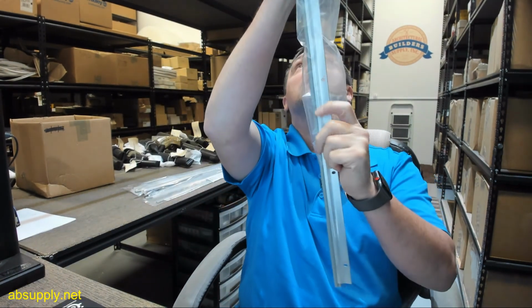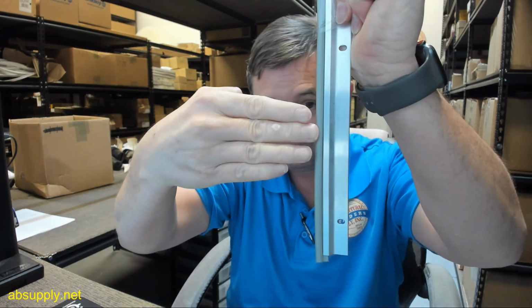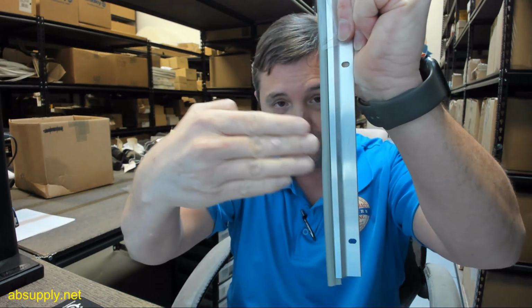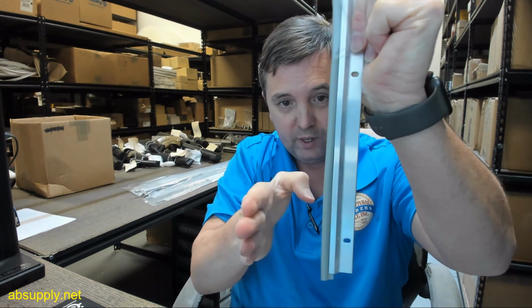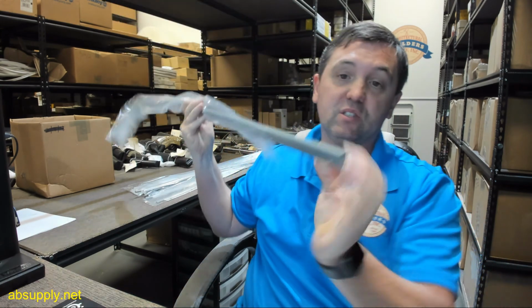Occasionally you'll see the material is installed as an astragal, but it's not appropriate really for an astragal. And very often when you see it installed as an astragal, the seal's ripped out because it's not really meant for two pieces to make contact in this fashion. Just when it's perpendicular to the face of the materials, really, is when you're going to see that.